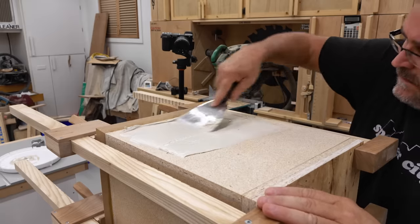The important thing to watch out for when you're doing this is to not block the vent. I'm going to lay the speaker down on its face so that the back is pointing up and I can get the plate amp put in. To fasten it, I'm using number six pan head screws that I painted black. Normally I flush mount this kind of hardware by cutting a recess, but I didn't see the point in doing that here because it's on the back of the speaker — you're not going to see it anyway.